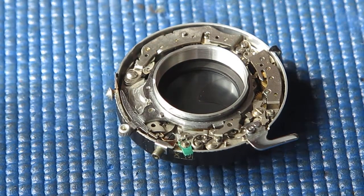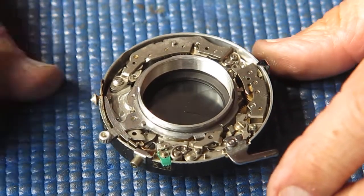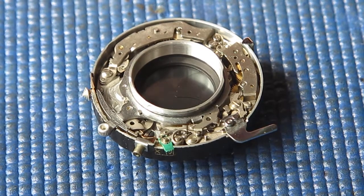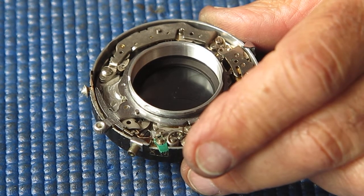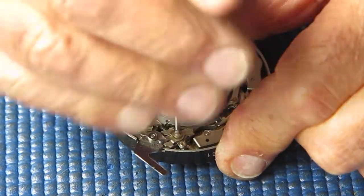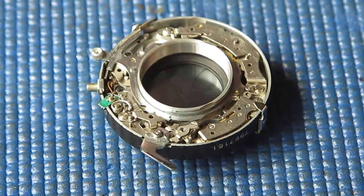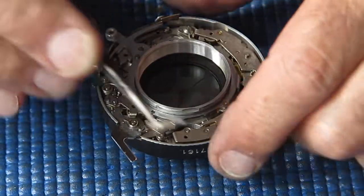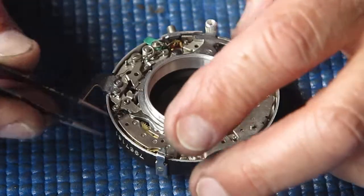Let's start. I'm going to start here. Make a note of that screw. This spring holds back this little lever — I've got photos of all this to help me reassemble it. This lever — it's loaded. Let's get this lever off. Make note of where those springs go. Unhook that spring — that's the B lever. Unhook this spring and lift off the shutter release lever.